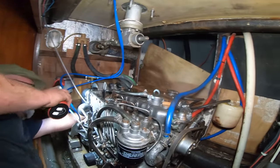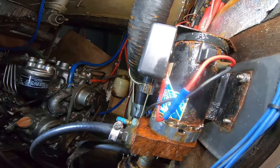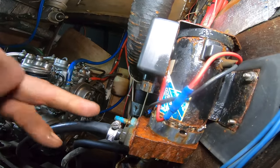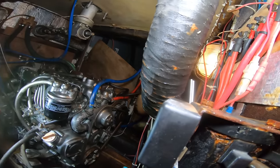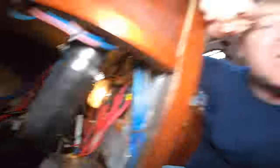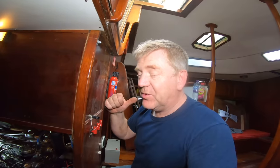Is there a water trap? See if there's any water in the diesel. There's a filter there - a Racor with a water trap. Does any of this need to be changed or just cleaned up? The fuel pump there - it's going in but no out. So it's not in commission. That fuel pump, because this tank is higher than the engine, I think that fuel pump was for when it was in the keel - it gravity fed it. So the long and the short of it is that the fuel tanks were in the keel on this boat. They've been decommissioned and the new fuel tank is there, which is pitifully small, but at least it means it's a get-you-home jobby and we can recommission the big tanks in due course.